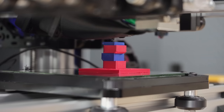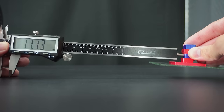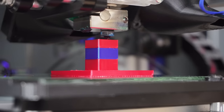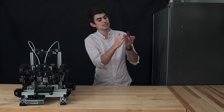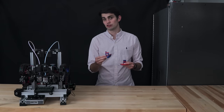The extruders will alternate the printing of these cubes. If the cubes are not perfectly aligned, then the offset values need to be adjusted. Fortunately, it is much easier to measure the alignment of the cubes with calipers. I will repeat this calibration print 3 or 4 times until the transition from the red cube to the blue cube is seamless. Once I'm happy with the offsets, I move on to printing a dual extrusion version of Benchy